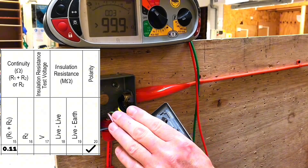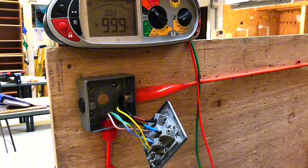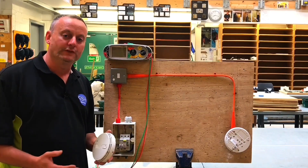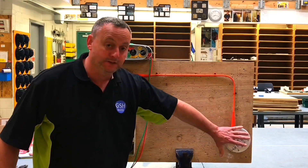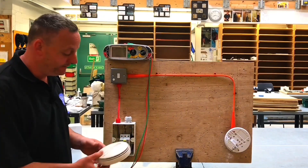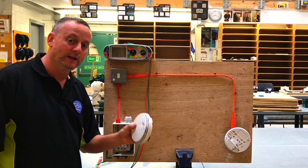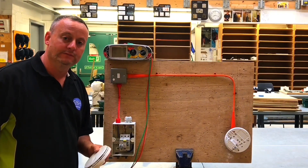Covers are now returned and the fuse connection unit goes back on. However, we're going to leave the smoke detector front off in order to carry out the next test, which is insulation resistance. There's just one thing to bear in mind this time: because we haven't fitted a smoke detector or heat detector before, this is full of electronic components and needs to be out of circuit before passing 500 volts DC through it during the insulation resistance test.